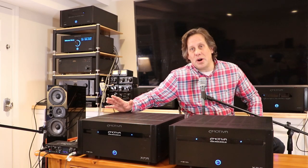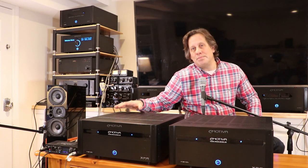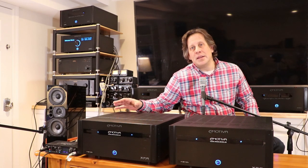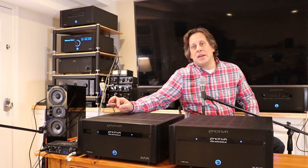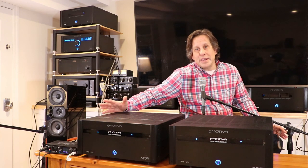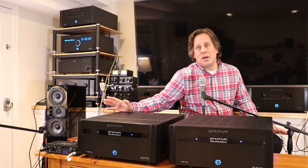John here from Ripe Wave Audio. In this video we continue answering the question: do the new Emotiva XPA DR2 Gen3 amplifiers sound better than the XPA1 Gen2 monoblock amplifiers? At the end of the last video we thought the Gen3s sounded a little better, even though they were stereo channels with a switch-mode power supply versus a monoblock running on a toroidal power supply. The best way to do a fair listening test is to strip everything down — turn off any filters, tone controls, and run the RMC1 processor in stereo reference mode.